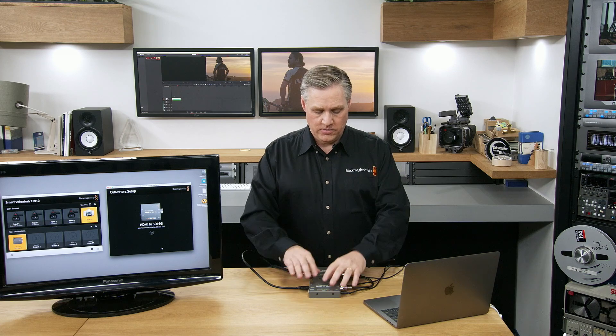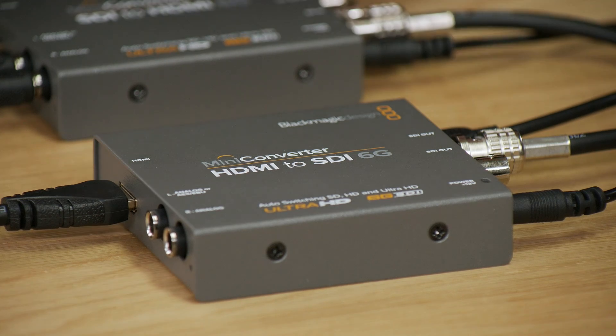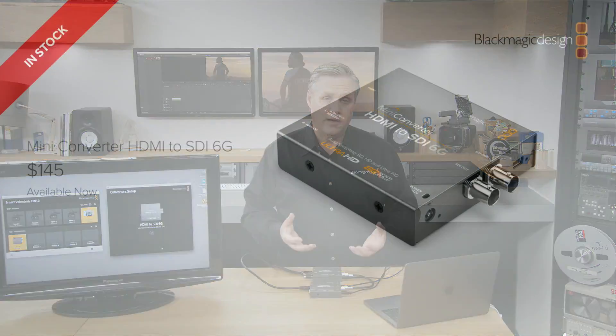To summarize that model — it's a little bit simpler. It doesn't need the same features as the SDI to HDMI monitoring model, but it's still a very powerful converter. It's a full 6G HDMI to SDI converter with automatic switching between SD, HD and Ultra HD up to 2160p30. It's got separate HDMI, balanced analog and AES-EBU audio outputs. And even if you don't need the video conversion, it's wonderful just to be able to convert audio into an SDI feed. This model is also cheaper than the HD model it replaces — available today at $145.